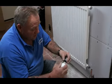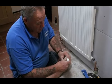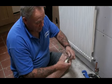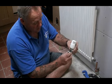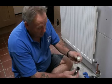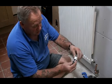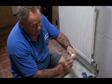So the thermostat screws onto the top of the valve, and to screw it on properly you'll need to set it to number five, because the further down the plunger the harder it is to screw on. So that's on number five — fully open — and that screws on nicely. If you're going to take a radiator off and you've got a thermostatic valve, when you buy your thermostatic valve look for a valve that comes with a replacement cap, and a lot of them do. You take the thermostat section off and you put the cap on — it's almost like a lock shield cap — and by turning that tighter and tighter that closes the valve fully.